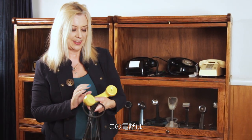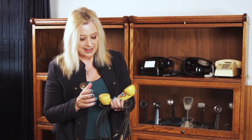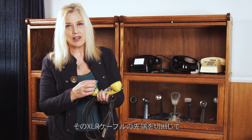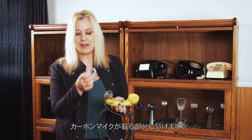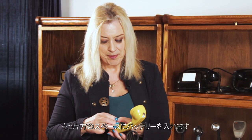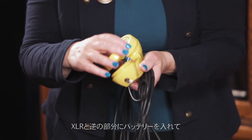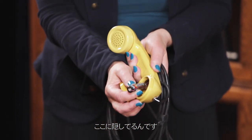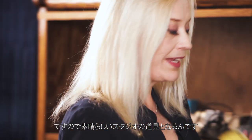This telephone was one my father showed me how to modify so that it can be used as a microphone in the studio. I just took an XLR cable, cut the end off, gutted the phone, and attached the XLR cable to the little cradle where the carbon button sits. To bring it up to line level, you add a battery across one side of it — I hide the battery in the handset. So now it's line level, coming right out of the XLR cable. I have singers use these all the time for effect vocals. It's a really great studio tool.